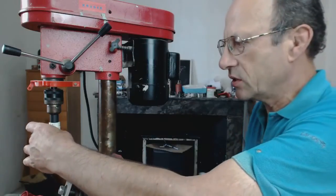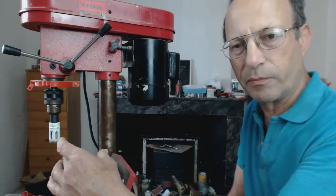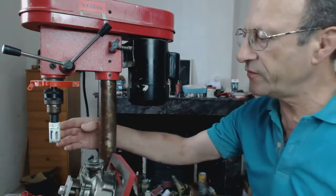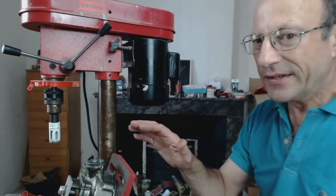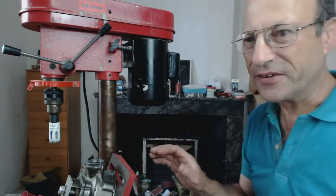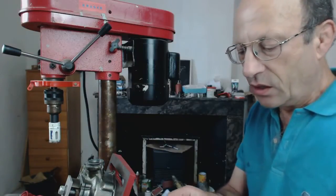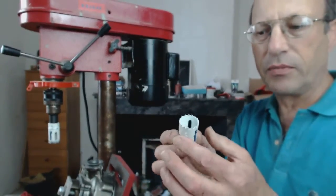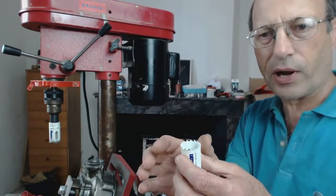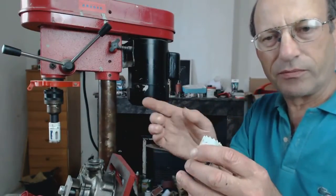What I've also noticed is that as the tool has gone down, it's got better — it was cutting bigger. Some of the teeth are just out slightly. These tools aren't designed for precision milling at all — they're for sticking holes in stuff. So when you get them, check them. For the 29mm, I could see one or two were just proud, so I've actually ground them down a little bit to clean them up.